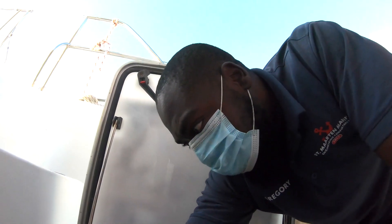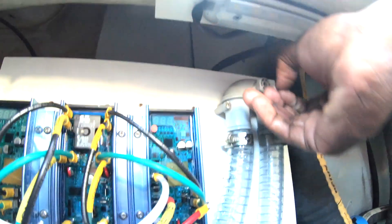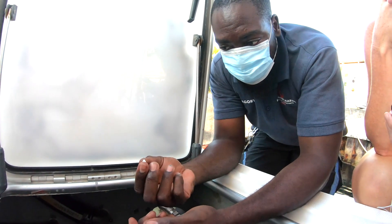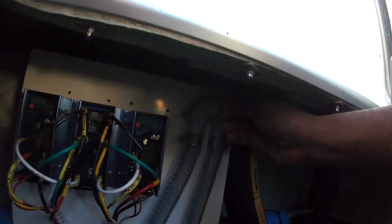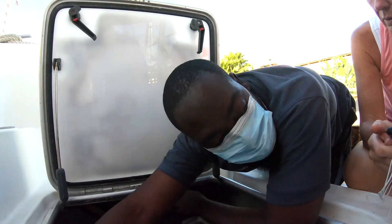The only maintenance item is right underneath there — that wire piece. You just unscrew it. Over time, during winterization — say you stop the bilge and aren't running it for two to four months — what would happen is you pull that off, unscrew it, and you have that small valve right here. It will be full of salt buildup and that hose will be leaking water — that's when you know it's time to service it. You just take that off, take it to fresh water at the sink and rinse everything, then pop it back in. If you run the engine all the time, it would be much harder for salt to build up — the salt builds up mostly when you're not running it.